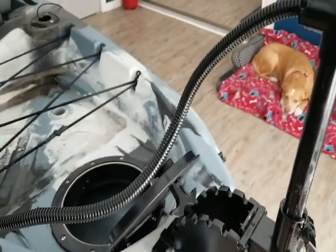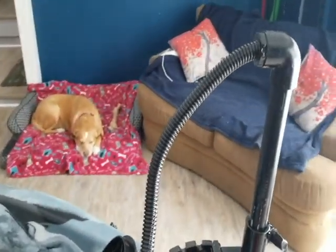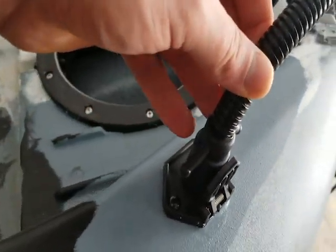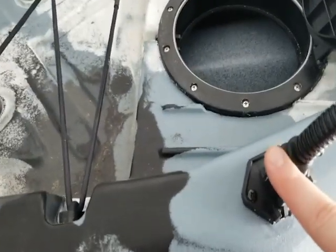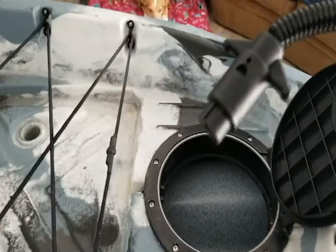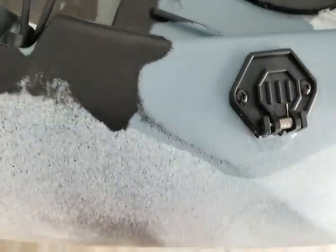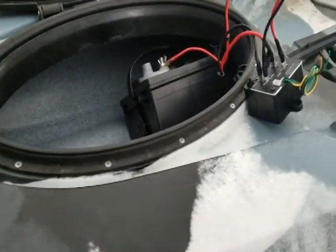Next we'll talk about the wiring of the motor. There are four wires that come out of the shaft of your trolling motor when you take off your head unit — that's going to be a red, black, yellow, and blue wire. For this specific modification, I only utilized the red and black wire. Those come out and attach to this Minn Kota receptacle — you can buy them off Amazon for about 40 bucks for the pair. It's basically just a plug: you mount the plug onto your kayak, it flips open, it's noise and waterproof, and when you connect it it creates your circuit. From there I ran my red and black cable all the way inside the kayak, all the way up to the battery and some components for the battery.